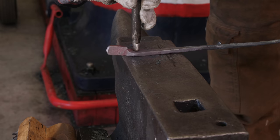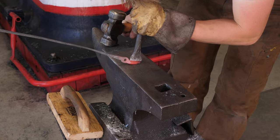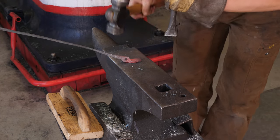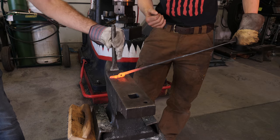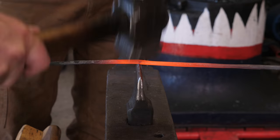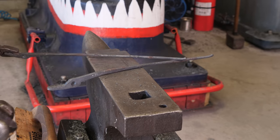We're gonna flip it over. Oh, so it's basically out of there. Hey, look at that! Now what we're gonna do is put a groove in it. This is what is gonna grip our stock. You can also do a little cross-hatching on the tongs. There we go, that's it. Perfect, and then rotate as you hit. Woohoo! As they say in them southern parts, yee-haw.